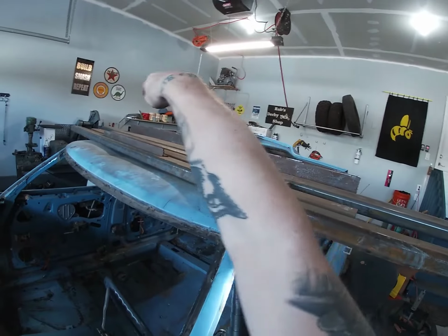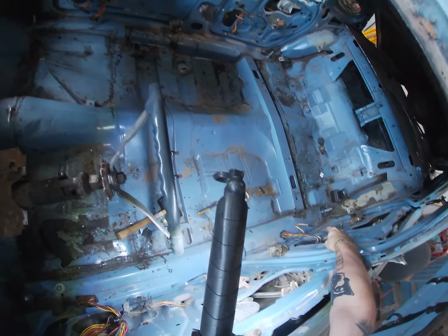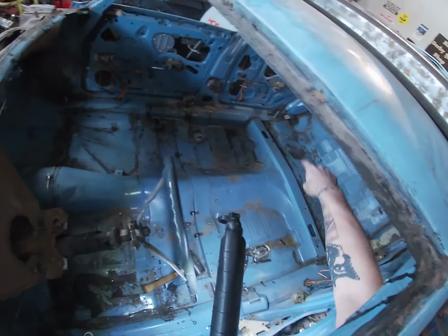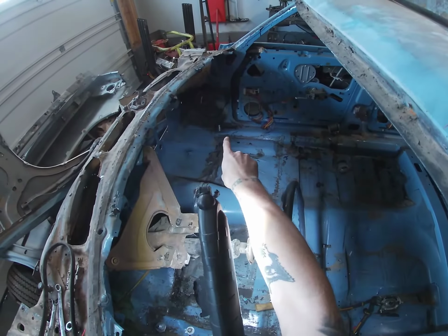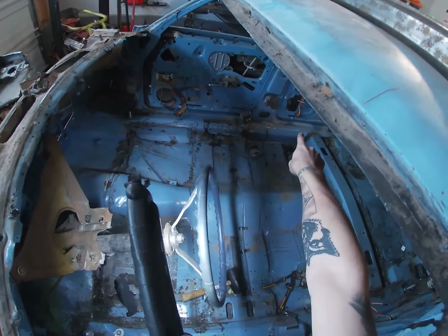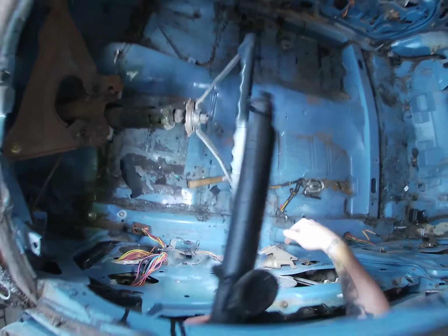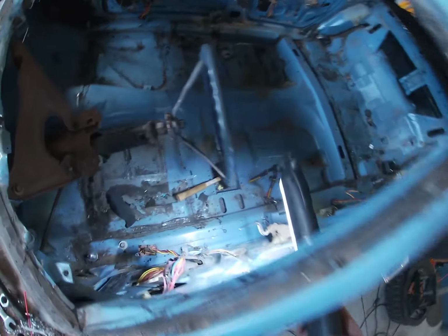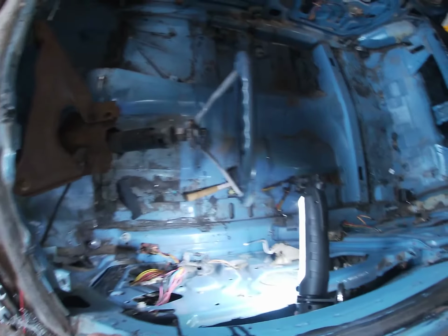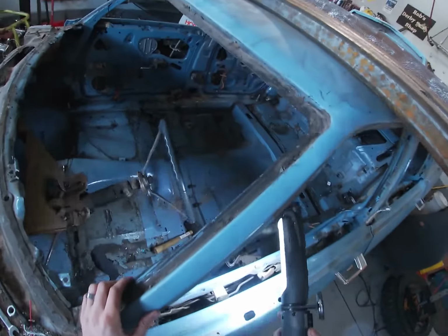Halo bar across the top. A back bar can run from your 2 vertical bars behind the seat, so that'll also be one of these. And then we get 2 bars connecting the front vertical bar to the back vertical bar. So we'll have one there and one there. And actually, I'll add a few more bars on this side since this is my driver's side, for protection. And that's pretty much the cage.